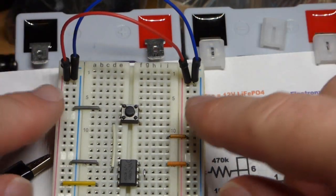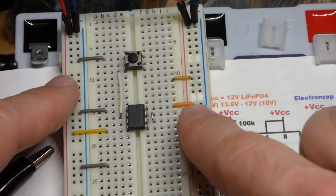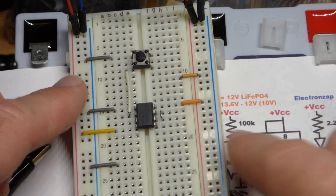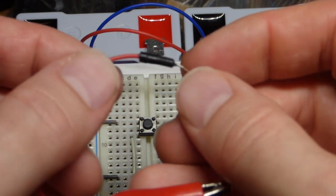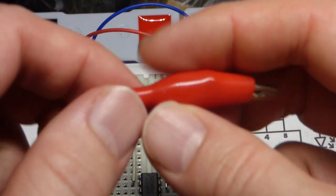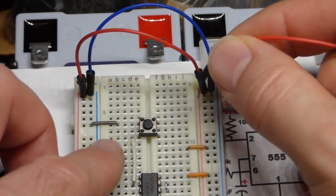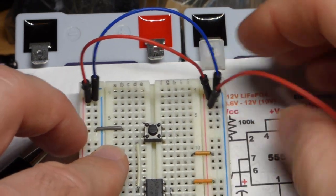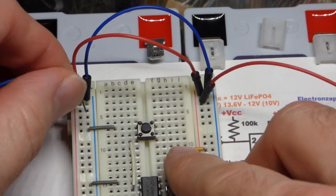To begin, we want to make sure each power rail has the same supply, because this breadboard has positive on both sides and negative on both sides. I took a couple of breadboard jumpers and connected them across to link the rails. Make sure positive goes to positive — be very careful, because the battery will fry the breadboard and components if we do something wrong.